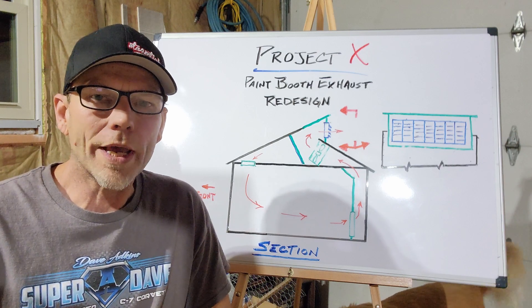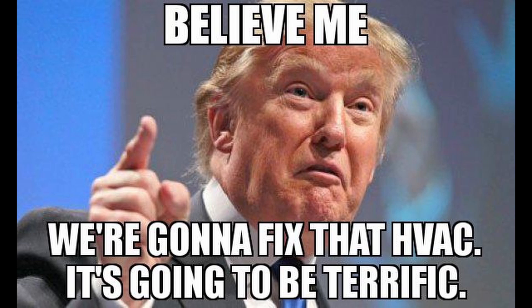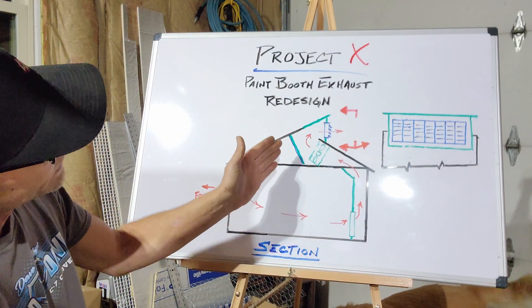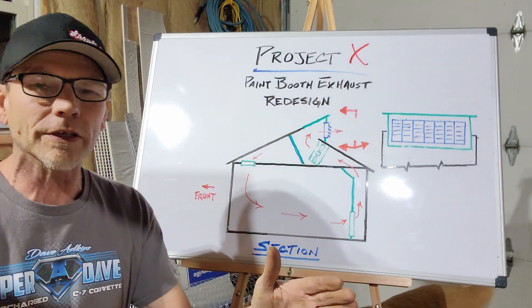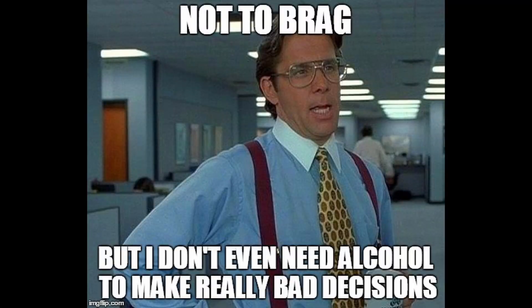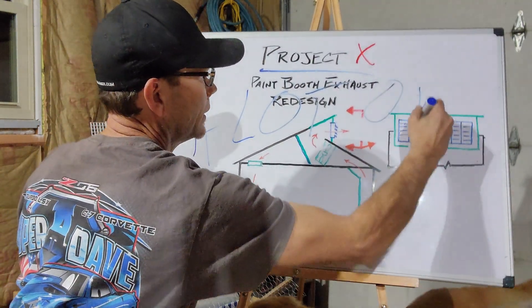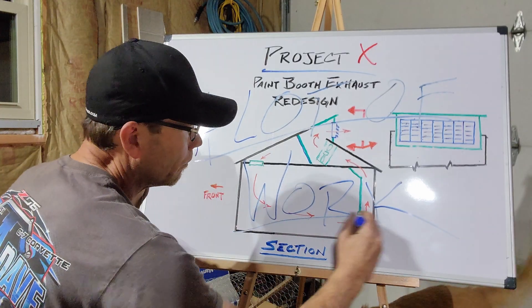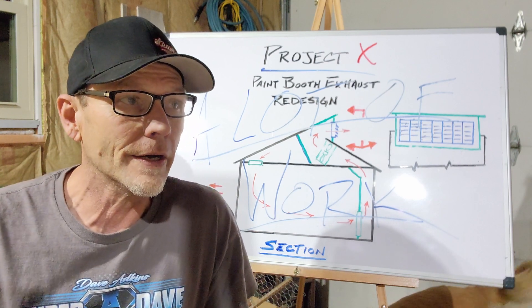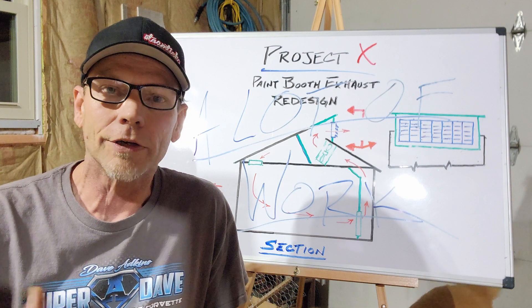Let's go back to the handy-dandy whiteboard. Here we are, and I wanted to go over a few things. We're going to make some changes to this paint booth design to make it more efficient. We were going to 45 the back wall to make the airflow better, add the louvers, make the air come down from the top, suck down — be a downdraft system with negative pressure. And it was a great idea. It really was, and it works pretty good. I'm going to show you that in a minute, but I'll tell you what — this is a lot of work. I spent months doing all the stuff you're about to see. There's probably a lot more efficient ways to do it, but I'm happy with it. It's turned out good.